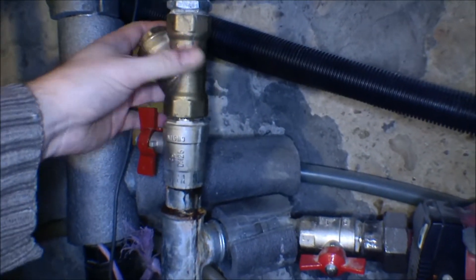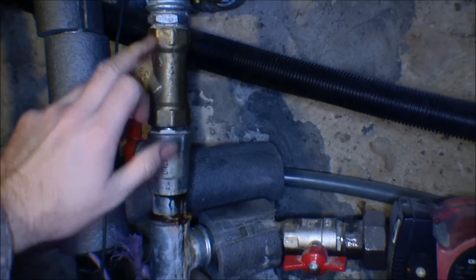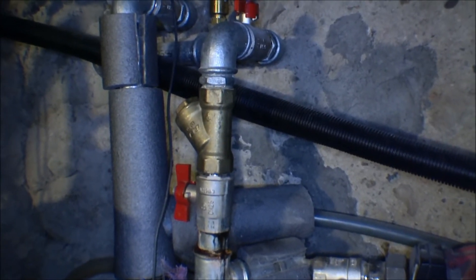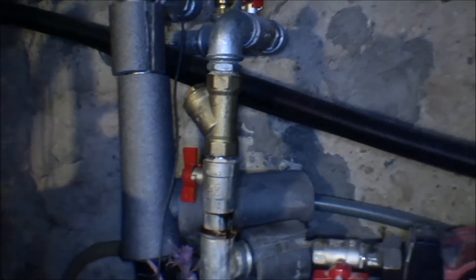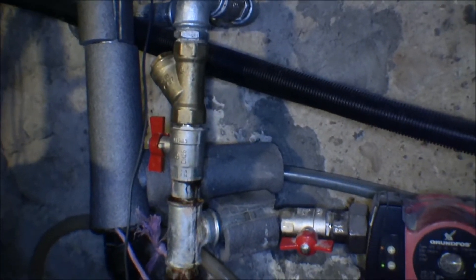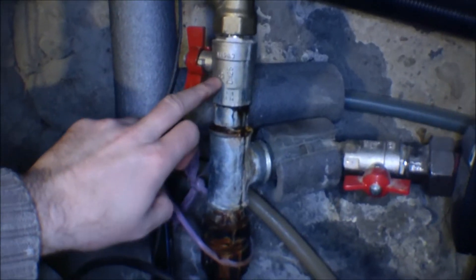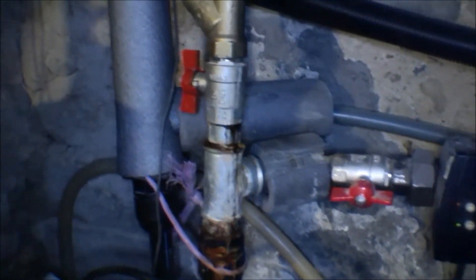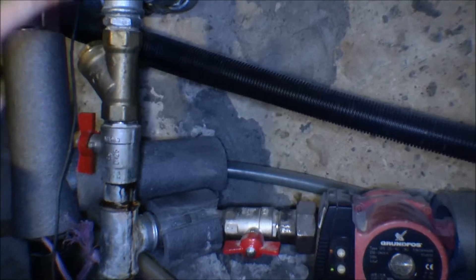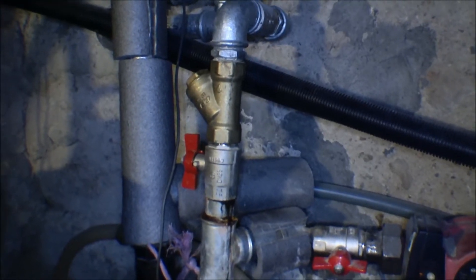I have a filter here — this part. That's a dirt filter for the water that goes out into the pipe. Large pieces of metal and stuff like that won't go into the heat pump and damage it, so there's a rough filter in there, and that tends to clog up. I have this little thing, and I've very conveniently put a valve on this side and a valve on that side — that's no coincidence. When I have to clean the filter, it's very nice to be able to close the water off on both sides, otherwise it will just pour out.